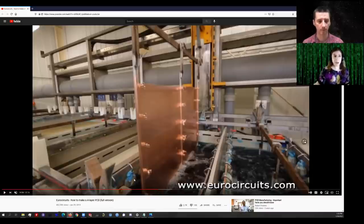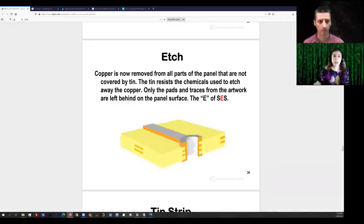You can't just use any type of copper — usually it's a high-phosphorus, ultra-high-purity copper. The only intentional contaminant is phosphorus, which helps the copper to properly corrode off into the bath. There's complex material science for why, so I won't get into that. But it's usually high-phosphorus anode bars with no other metals — you only want pure copper. There are special copper alloys used specifically for electroplating. Similarly, if you electroplate tin you'd use very high purity tin; if you electroplate nickel, very high purity nickel.